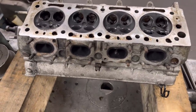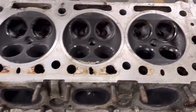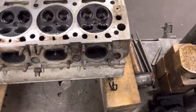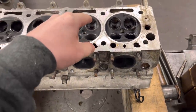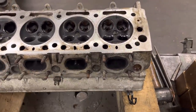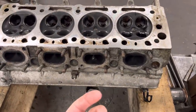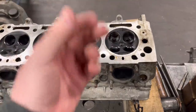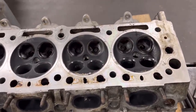Right, so we've got the Sapphire Cosworth cylinder head and we've got to do some porting on this — we've got to take it out to 26.5mm on the port, going fairly aggressive. Carlos is just going to remove the existing valve guides. These valve guides have two different sizes: seven mil on the inlet and eight mil on the exhaust. On the back of the guide it's important to knock them through from this end, because on the back is the circlip, and if you try to knock them out the other way the circlip is either going to come off or it's going to start pushing through the aluminium where the guide sits.